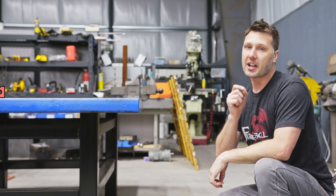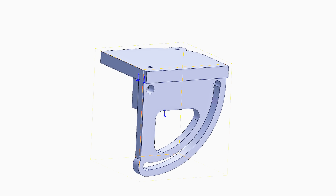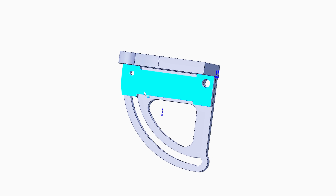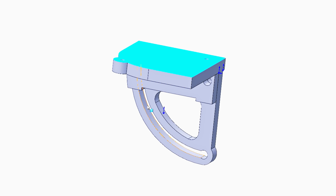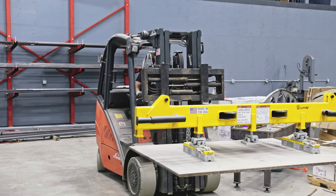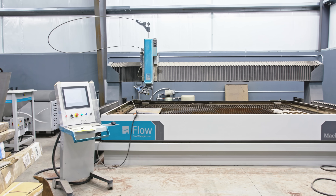Let's go into CAD, drop these components, and see what we come up with. I want to build the bracket in virtual space, so I'm using a tool called SolidWorks. This gives me a better understanding of how the parts fit together and lets me check for weld and part interferences. Once I'm happy with the way the part looks, I can save the file as a DXF, which turns the CAD model into a language that the WaterJet can read.